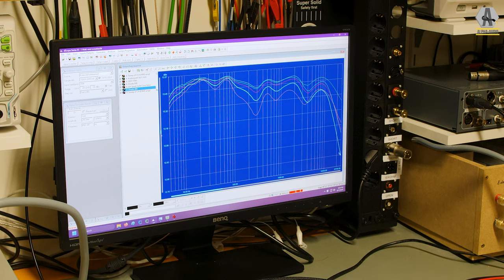So the difference between this and this is more than 1.3 dB, and this is only 0.3. So this is a huge difference in response between these points. The extension of the AudioQuest is actually better than the Dryade. And if I pick the orange one, the ArtSpeak, it's already smaller, so the high extension of the ArtSpeak solid core is better. But overall, it makes quite a wave through the graphs. The most stable one, I think, is the QED, it's pretty good. But overall, the AudioQuest Slip 14-4 is the most neutral cable in this bunch.